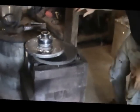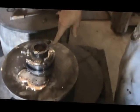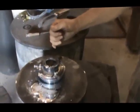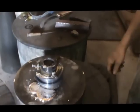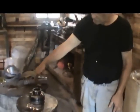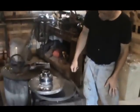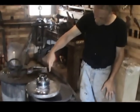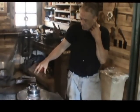Another issue we had when pouring this is, as I was filling up the babbitt material in here, it seemed like some of it was leaking under this dummy shaft, and we had put babbitt down in there and tamped it in really good, hoping to prevent any from coming up inside the hollow shaft. One thing we learned is we should have welded a plate inside this dummy shaft at the bottom. That way it wouldn't allow any material to come up inside. It's really important to soot your dummy shaft so that when it comes time to release, which you'll see later, once this is all cooled, we'll try to press that out of there.